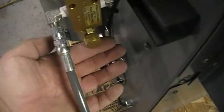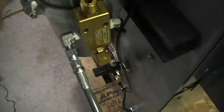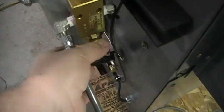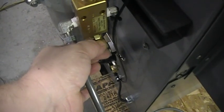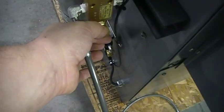This little knob here is your system drain. It's going to drain all the air that's trapped in the purifiers. So when you want to change filter cartridges, you're going to need to use this. I'll attach a separate video that shows how to change a cartridge. Very standard. You're going to drain the air out of there. Once all the air is drained out, you'll put a wrench in between these two heads and spin it out. Pull the old cartridge out, put the new one in.